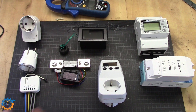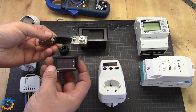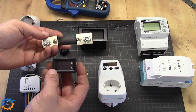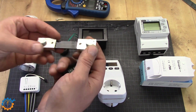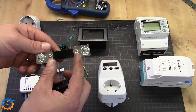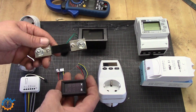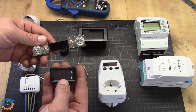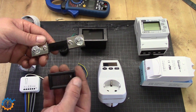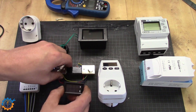You also have other types you can hook up — like this one here for measuring DC voltage to your battery bank. It's very simple. You have the shunt here, and by hooking up the cables you are measuring the voltage drop between two points when drawing current through. That will show the current on the display, and this one also shows the voltage. Very simple, very cheap, and can be found everywhere.